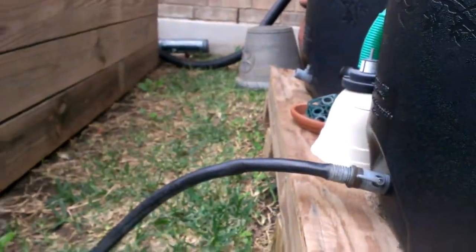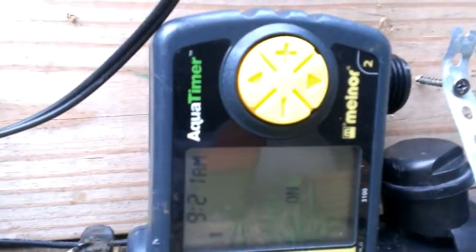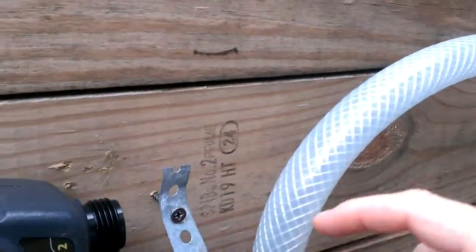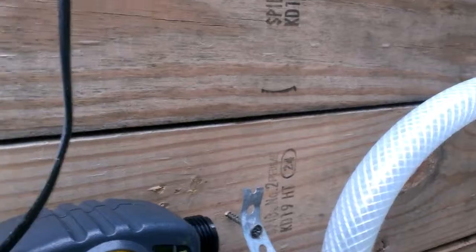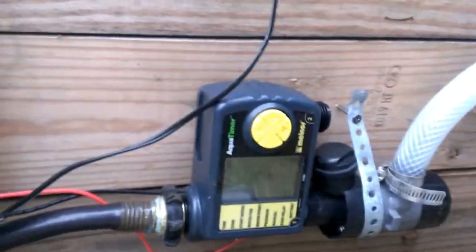So the way this works: water comes into the rain barrels from the catchment system, it's fed into the timer valve. The timer valve is set to go off every day at 6:15 in the morning — that releases, opens up, and lets the water into the tubing, which primes the system. That's just gravity fed. In fact, the system can run off gravity, but without enough pressure to squirt out of those taller sprinklers, I wanted to add a little bit more oomph with this pump here.